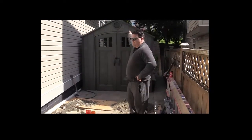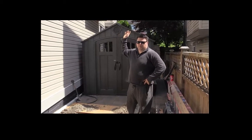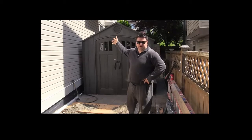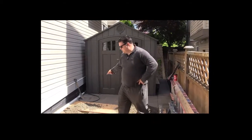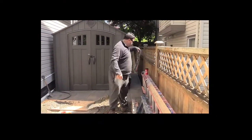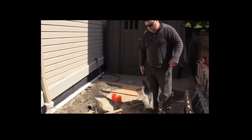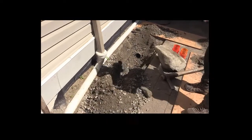Yeah, so up front there were some water leaks. We fixed those right down to the drain tile system with the waterproofing system. Backfilled 100% with gravel. So the water goes down, gets in the drain tile, comes here. But when we got to here, there was a crushed pipe. There you go. So that was stopping 90% of it from getting here.